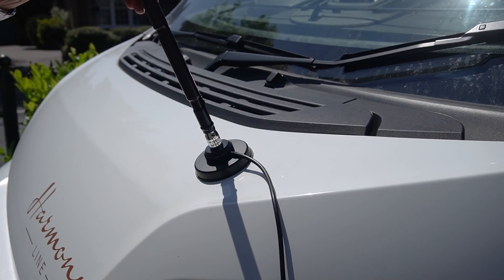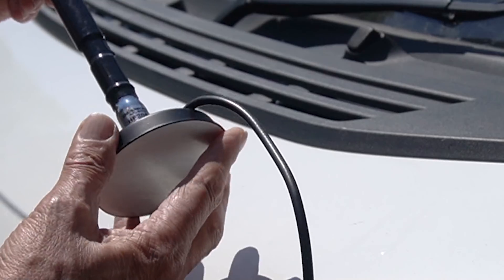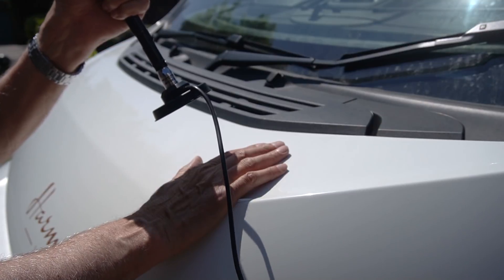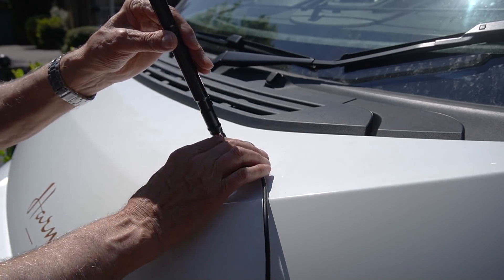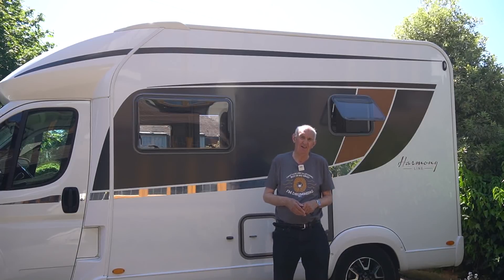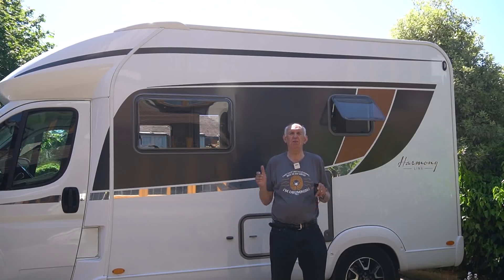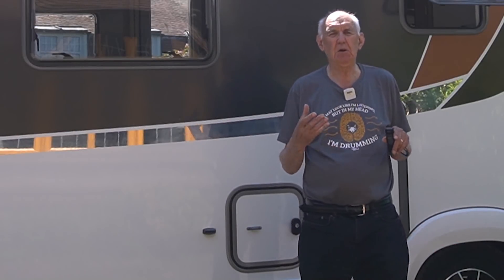Things were working against me a little bit with this assembly. Although I've got the mag mount, it's rather small. It's debatable whether it will be very good at 14 MHz, though I suspect there is enough capacitance there at 14 MHz — certainly no lower. So I've got the metalwork of the vehicle — basically the bonnet and all the chassis connected to it and the doors. It fits nicely on there, but it's a small mag mount. I was intrigued to see what would happen. Things didn't go well to start with, taking me back to times when I've spoken to guys who've had problems matching their antenna system. It wasn't working well.